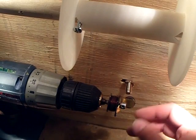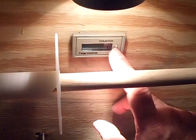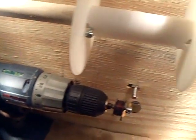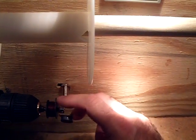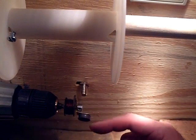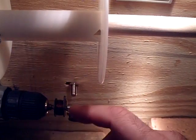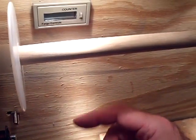I have the magnet here, all aligned on the magnetic sensor, and there is the counter. I got my drill all tightened in so it's not going to move, and this is loose enough so it will turn. When I wind the coil I'm going to tighten this up so I can put a fresh spool of number 40 wire on here and wind it and count the turns that go on — but now I got to count the turns that come off.